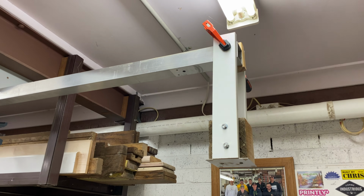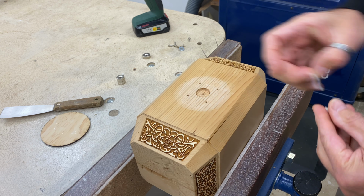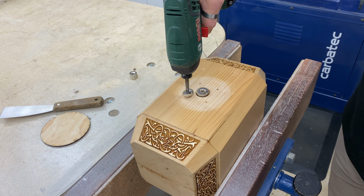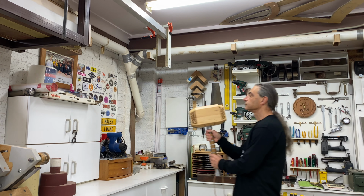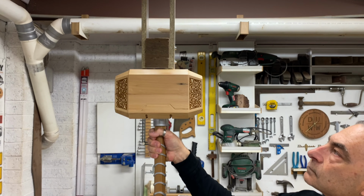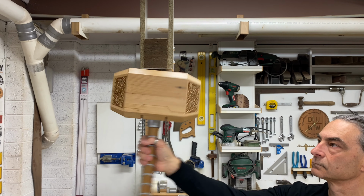In the final video, you saw me glue on this cap, but as soon as I glued it on, I removed it and removed the glue because I knew that I'd have to get to the top of the hammer to install some magnets. So it was basically replaced with double-sided tape for filming. So as you can see here, I added 5 rare earth magnets, and these things are super strong. And as you'll see here, that's a really tight hold. It's so strong, there's no way you can pull the hammer directly off. But if you push it to the side, it comes off so easily.